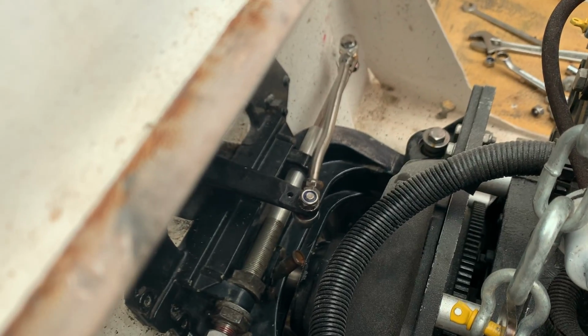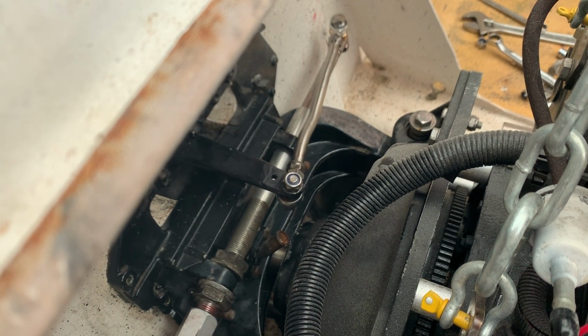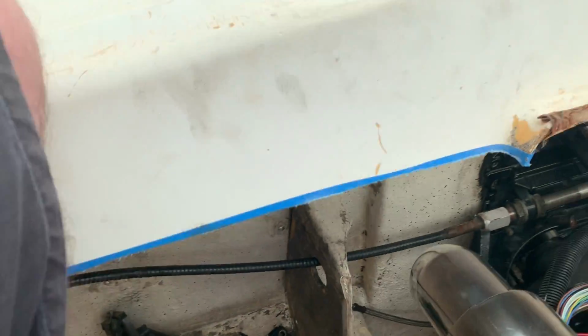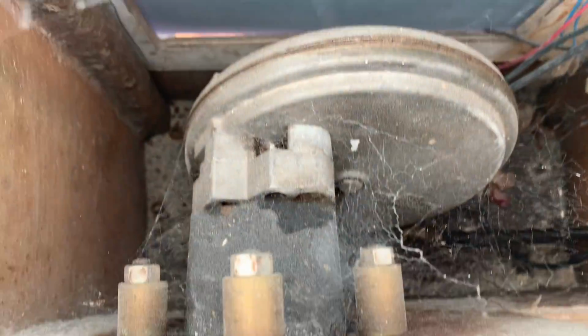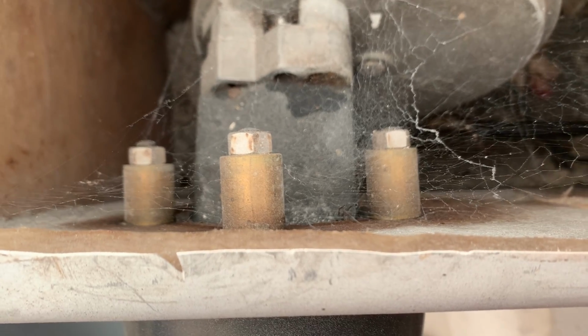I've got my steering connected with my new Hoover Doover link, which has got no slop in it like the other one did. A couple of rose joints and some stainless pipe, a few nuts, bit of welding. Beautiful. Of course, I probably showed you before that I reconned all the inside of the housing there. It's all covered in bloody cobwebs and leaves and shit now, but yeah, fixed that up, greased it all, put oil down the cable.